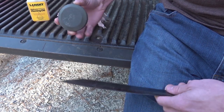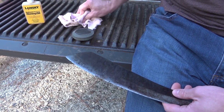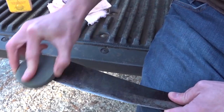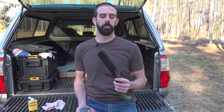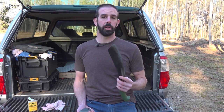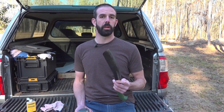Let's flip it over and work the other side. Apply another drop of oil — getting this stone wet really helps it cut better. When you see a lot of heavy nicks in your blade, you will have to take a lot of metal off to completely get rid of them. When there aren't that many, I'll leave them — I don't want to take that much metal off. This is just a beater tool for chopping and cutting; as long as 95% of the blade is pretty sharp, I'm happy with it.